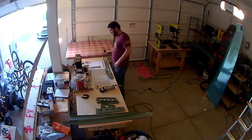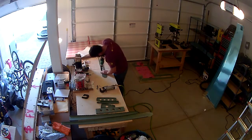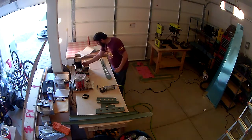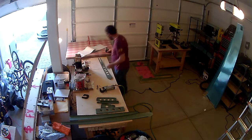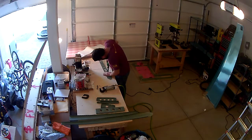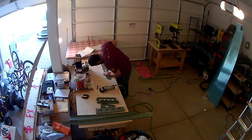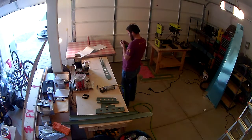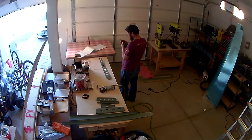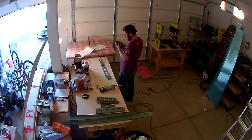So right here, I've got a cage set up on the drill that allows control of how much you're drilling, and this is actually right where I just made my fatal error in this piece, and why I ended up having to replace it and order a new one. At the end of the bit, there's a little guide nub that goes through and sits inside of the hole and guides the drill bit so that you're countersinking accurately. And what I didn't realize, being that this is the first time I've tried to do anything like this, is that that nub is also hitting the tabletop.